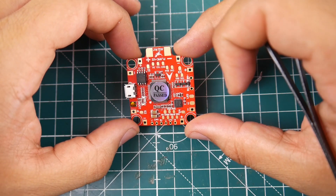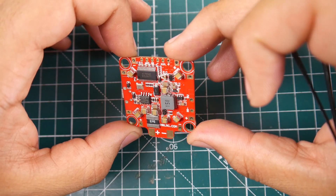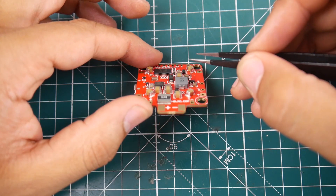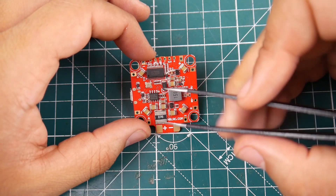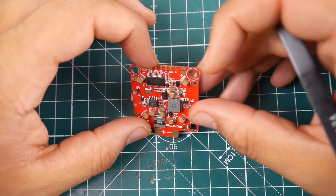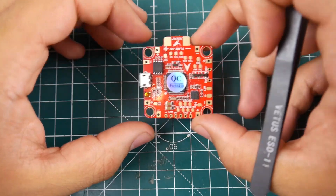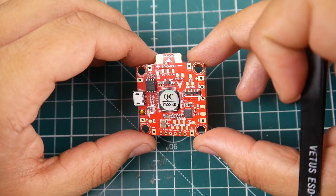However, I never found motor 5 — I don't know if I'm missing it. We had motor 6 but maybe motor 5 is on the bottom. Nope, nothing on the bottom. On the bottom we have the OSD chip, current sensor, and pretty big capacitors on board — really fat ones, but a little bit dangerous because you could pop these off, so be careful when putting this together. You do have current sensing, a 5 volt regulator, the OSD, and what looks like a little TVS diode. There's no barometer. You've got a little boot button — I hate these boot buttons, but they tend not to break off, unlike the other type which usually break off in the field. Overall it's a pretty minimal design.